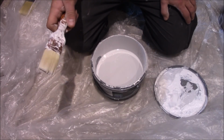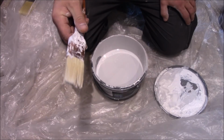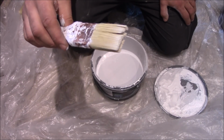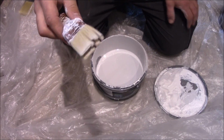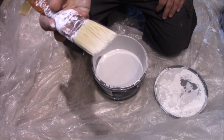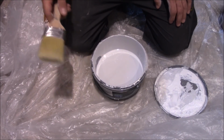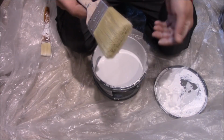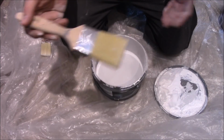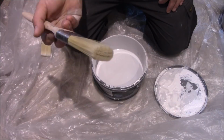Cutting the edges on the walls between the coving and the wall or window and the wall, I'm using this small stained paint brush. It's quite thin and it's very easy for the first cutting, as this must be accurate. The second time I'm cutting the edges, I'm using this brush. It's a bit thicker, but as you've got the first coat, you can use this one.